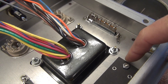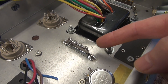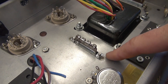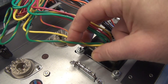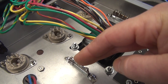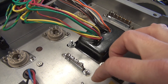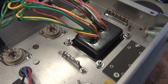This little ground will go over to the negative bias board. Over here we have another terminal board and they're all tied together — this is just a grounding point, soldered to the frame of the terminal board, and these studs are also soldered direct to the chassis. Because we have the filament line ground, the high voltage center tap — all that's going to land here. Plus it gives me a termination point for the resistors that come off the bias pot. This is a really nice addition. You just have to make some little itty bitty holes for the screws to come up through, solder it, and it really cleans up the wiring of the amp.